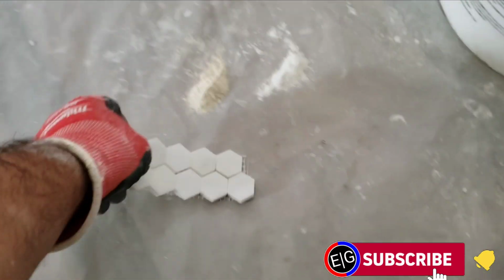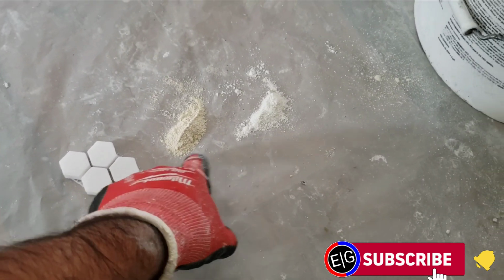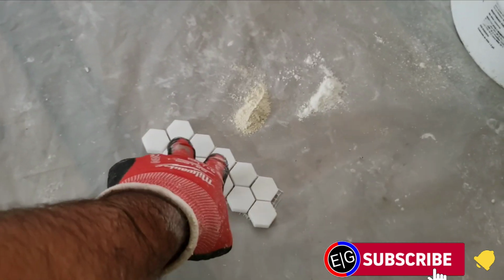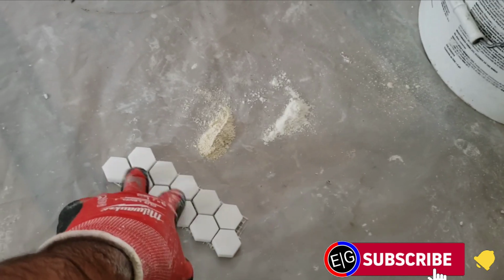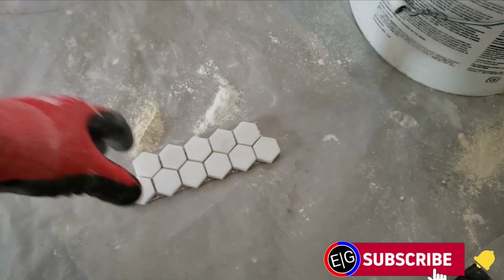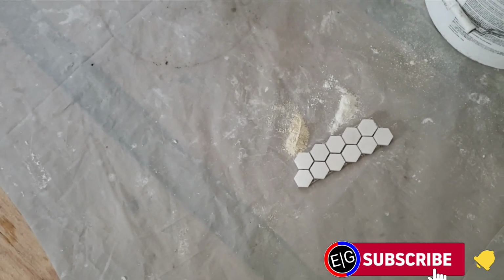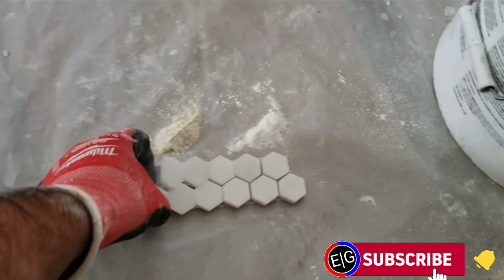Believe it or not, if I were to use half the room this color, and then switch to this on the other half of the room, eventually, with time, you'll start noticing two different shades in your marble. You'll notice that one side is whiter and the other side looks darker. And it's because of the variance in the color of Thinset. That's why it's important to use the right Thinset when you're using marble.